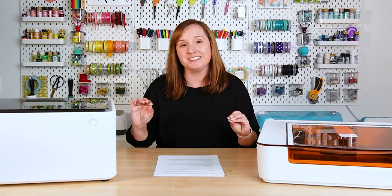A diode laser can do a lot of what a bigger laser can do, but it is limited in some ways. It is much less powerful and cannot cut quite the same things — in my big Glowforge Pro I can cut all colors of acrylic, but these are more limited. If you're looking to cut something much larger, you may want to save your money and get one of those CO2 lasers.